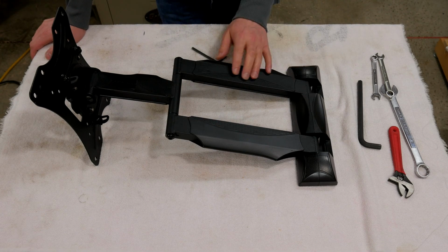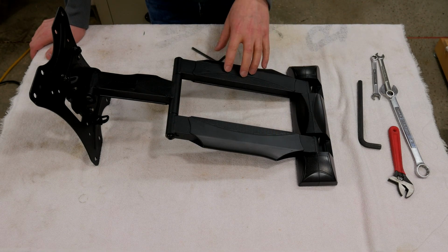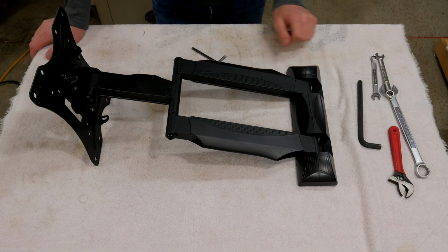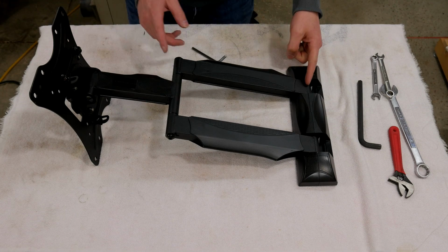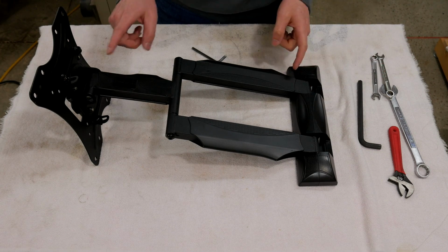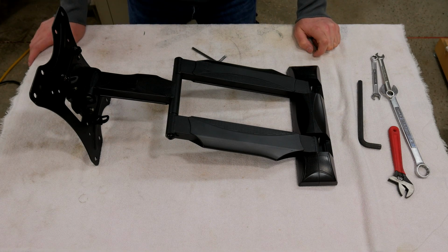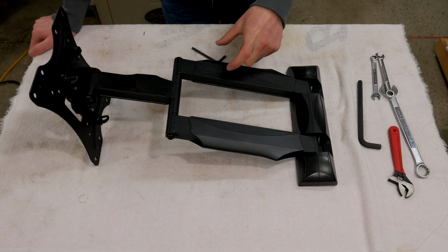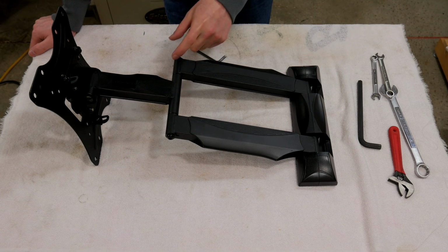Now, they also make several arms like this that don't have a top and a bottom. They just have a bottom one, and then they have this arm that pivots off. I had designed one like this myself. These arms were about 18 inches instead of like 11, which is what these are, so they were quite a bit longer. This one was going to be just as long. And where my design failed was because I had used 2-inch by 1-inch rectangular tubing,